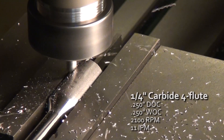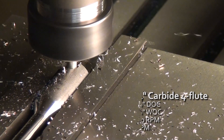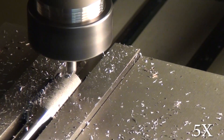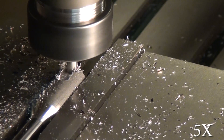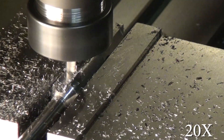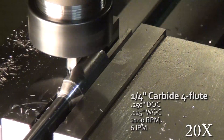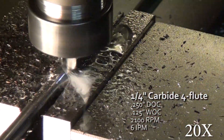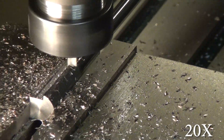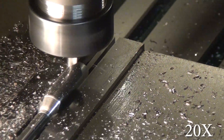As far as the machining goes, you'll notice that I crashed the mill three times before figuring out what's wrong — you're gonna see it right here. Did you see that? The end mill stopped. The reason is I didn't have it tight enough in the collet, but I went ahead and crashed it two more times before figuring that out. The surface finish is really terrible and I'm getting all kinds of really poor results. Mainly I think it's because I'm just a bad machinist. I'm using a quarter inch depth of cut and started with a quarter inch width of cut and eventually turned that down to an eighth inch width. I also tried WD-40 — that didn't help, and it didn't seem to matter what I did. I just kept getting bad results.